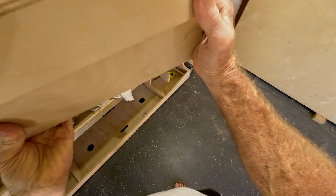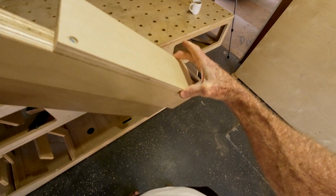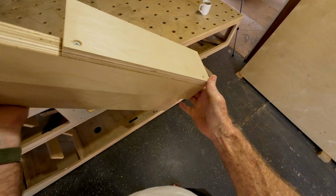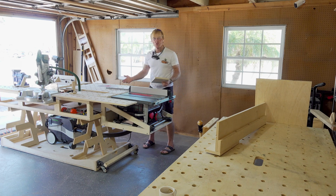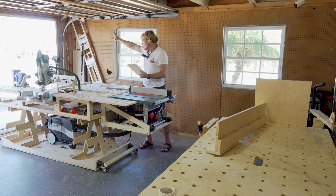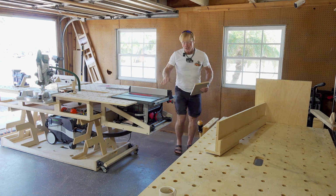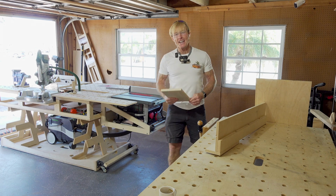I added a third piece. Again, another piece of 18mm. It's ripped to 3.5 inches wide and 12 inches long. So with my table saw hanging off of the Smart Station, I have all of the outfeed that I need. I don't need it any longer. It doesn't matter how long the rip is I'm doing. It's on the infeed side that it starts to make a difference.